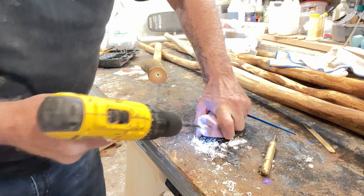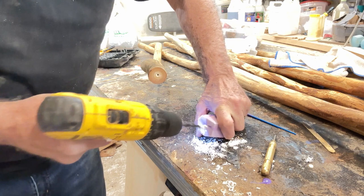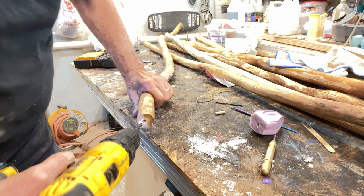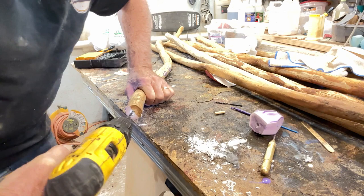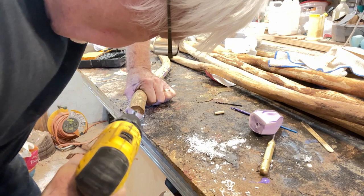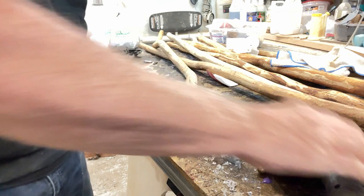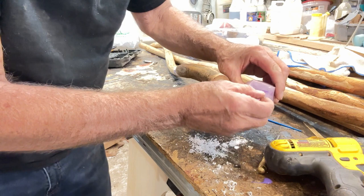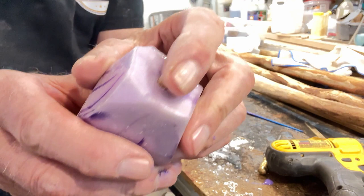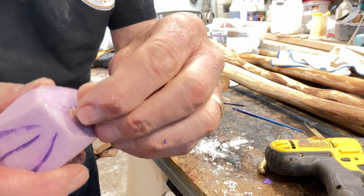When you're drilling holes there's always the risk — on these wooden things I keep my hand back at a distance so I've got plenty of room, hold it down solid, and then drill your hole. That pilot hole should make it drill a lot better; this is really hard wood, I can tell that already. Now I've got it in deep enough — we'll see if that dowel slips in there. As long as it bottoms out and you have some left sticking out, we're good, because we're going to fill that hole full of epoxy.